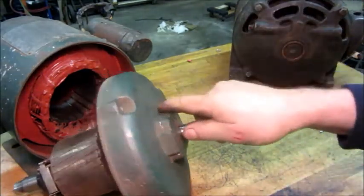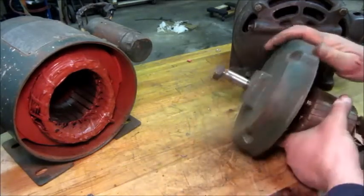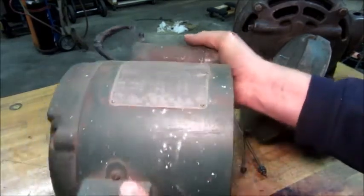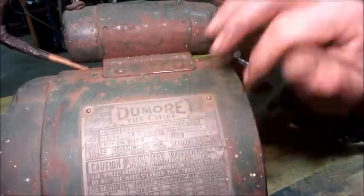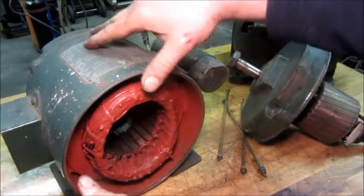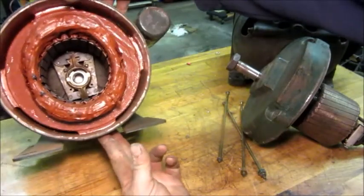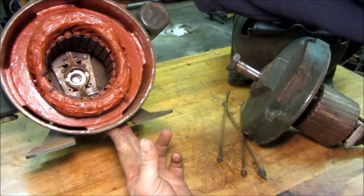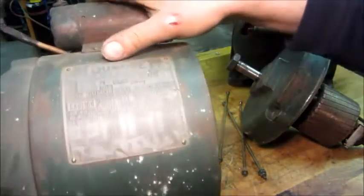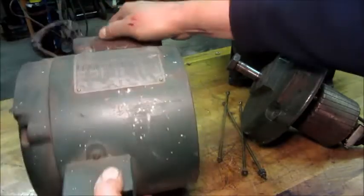This other one here is pretty early. It's got a copper induction rotor in it and it is a Do-More grinder motor. It's a two-pole motor so it would be 3600 RPM synchronous, running slightly below that. Two-pole motors in this one horsepower size — that's a pretty high speed motor for this era especially. It must have been some kind of special purpose grinder because they're talking about belt ratios and gearing it up with the belt to 7700 RPM for the grinding wheel. So that's pretty serious.